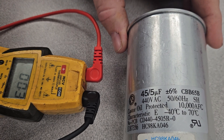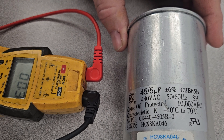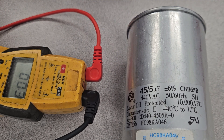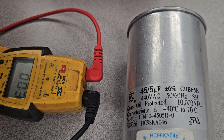Let's talk about capacitors. One thing I want you to know about them is they are storage devices with the compressor. They are actually attached to the start winding of the compressor so that it will get the motor up and running. Back electromotive force is what's going to shut that off for us, or stop the electrons from moving through that start winding itself.